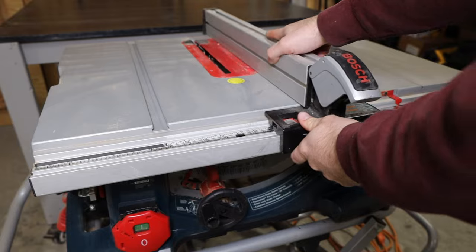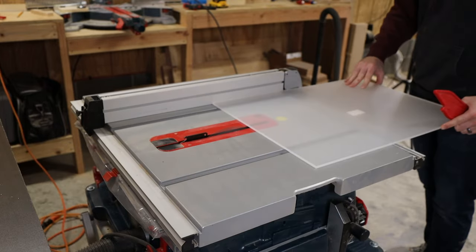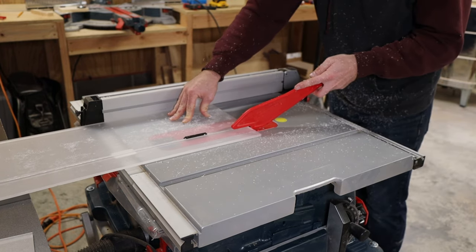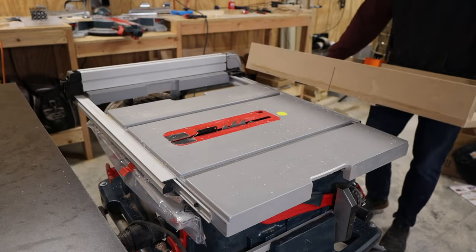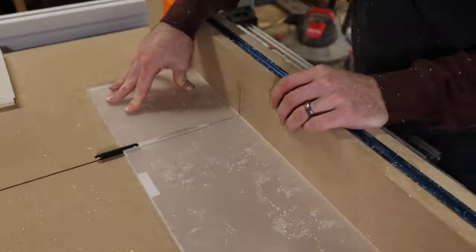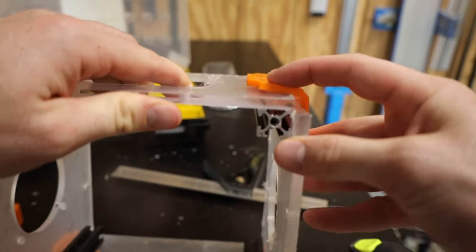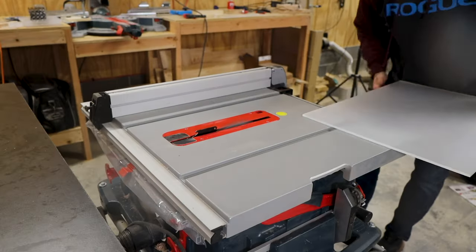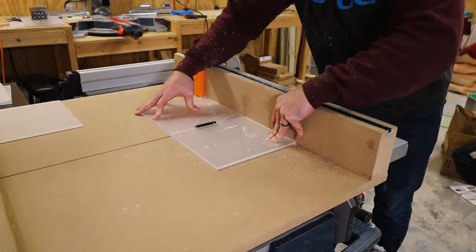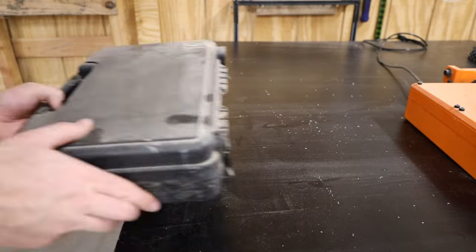Now with all the 3D printed parts done, it's time to get started cutting down the acrylic for all the sides. All the sides are going to be cut from quarter inch acrylic sheet, and I specifically designed the speaker to be able to cut all six sides from a single sheet of 18 by 24 inch acrylic, just to bring the cost of this project down. I initially ripped the acrylic into two strips of the right width, then used my crosscut sled to cut those strips down into six squares, but somewhere along the way I didn't get the dimensions right and ended up with not quite perfect squares. I didn't notice this until I had already made all the cuts on the CNC and realized something was off — not by much, but just enough to make sure the cube was never going to fit together smoothly. So I had to cut all the panels from scratch again, but this time I cut them oversized and then routed the entire profile on the CNC so I was certain they were going to be square and centered. Luckily I had ordered a spare sheet of acrylic, so I didn't waste too much time — but so much for saving money by only using one sheet.